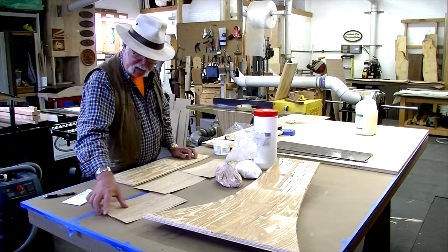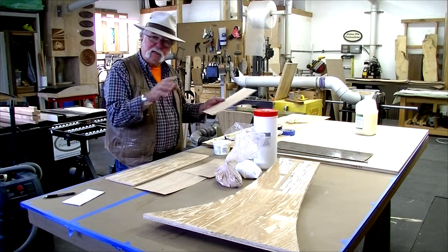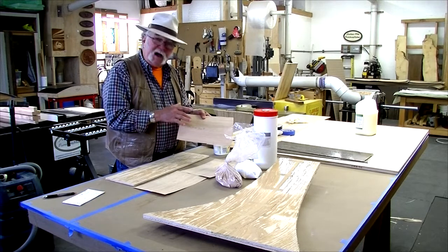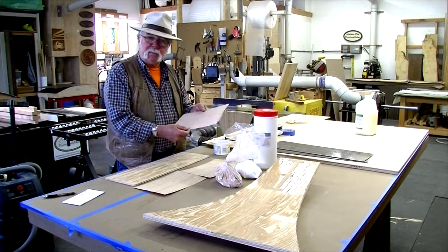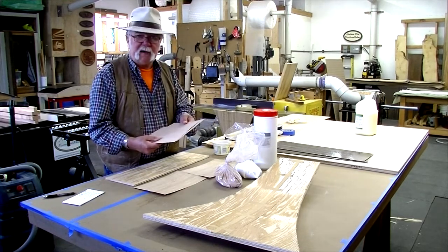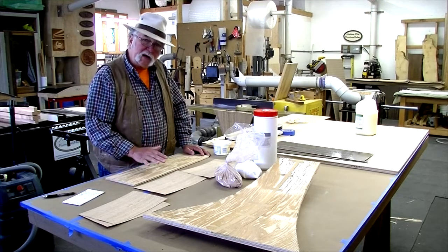The other side, I'm going to try two different mixes of blocker. I'll take what is left of the white and medium glue, and mix them together, and then add, first of all, about a 5% by weight amount of blocker. Try that on one sample, and then I'll do a 10% blocker by weight on another sample, which is the maximum amount of blocker that is recommended. And that way I'm going to get a pretty decent idea of the range of no blocker or using blocker.